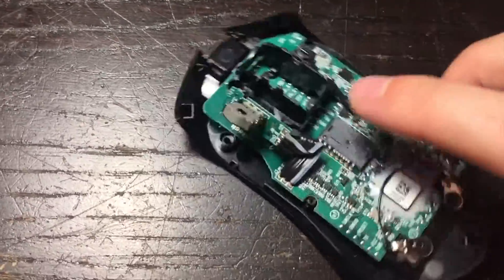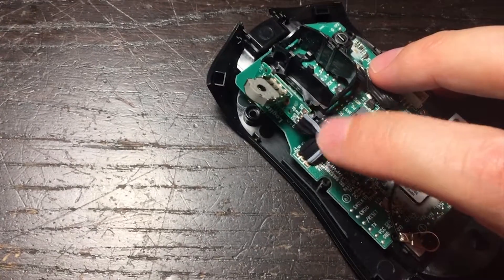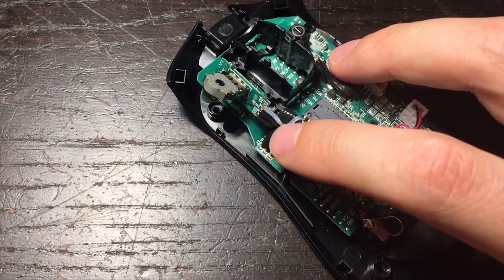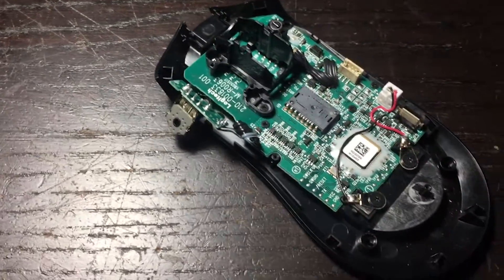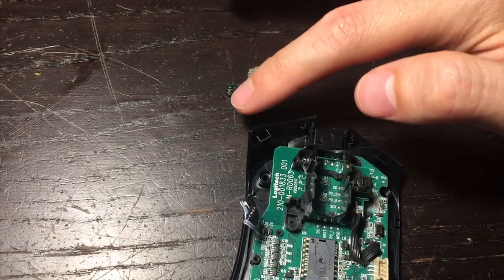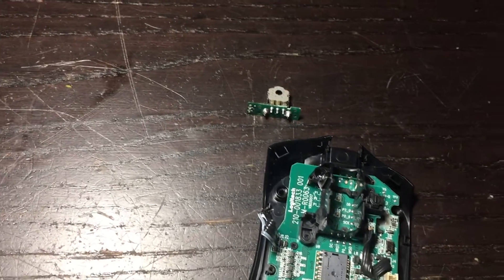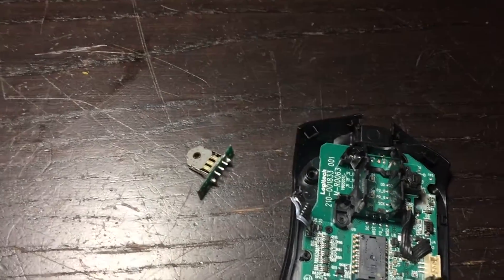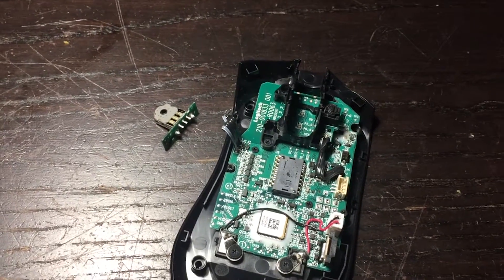Now what you need to do is remove this flex cable. Bear in mind that when you solder this, the flex cable will melt pretty fast — it's cheap insulated wire and the melting points are very low. Begin by removing those three wires from this board. I've removed the connector — it's pretty simple. You just put some flux on those three connectors, take the iron, feed it with some solder, melt it a bit and slowly pull it away. If you know how to solder it will be simple. If you don't know how to solder, good luck — you just need to learn how to fail and then you'll learn how to do it correctly.